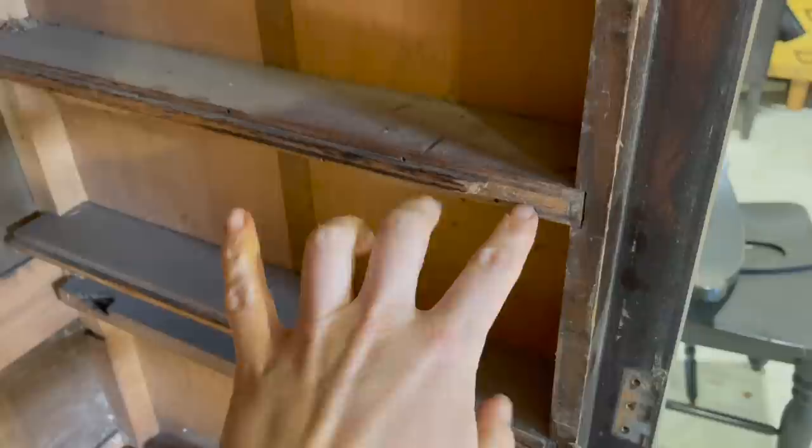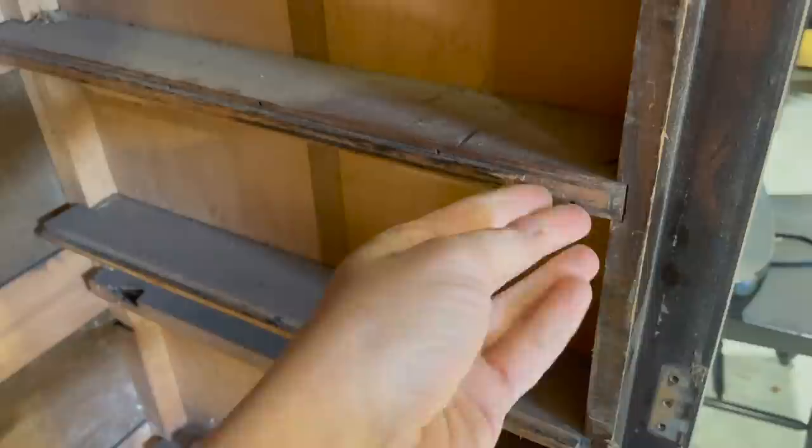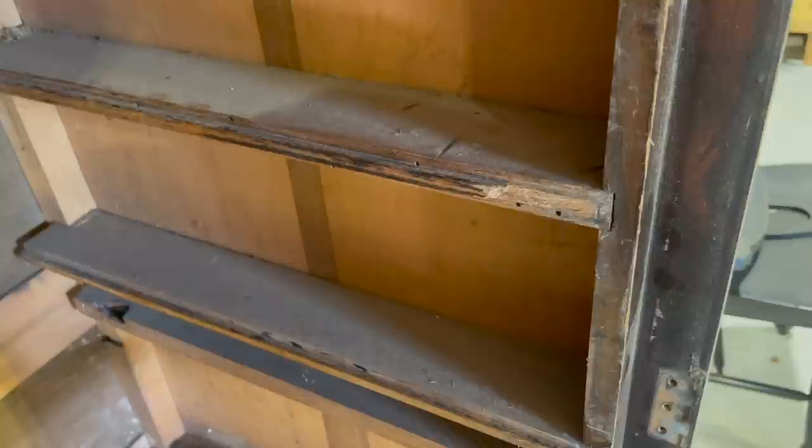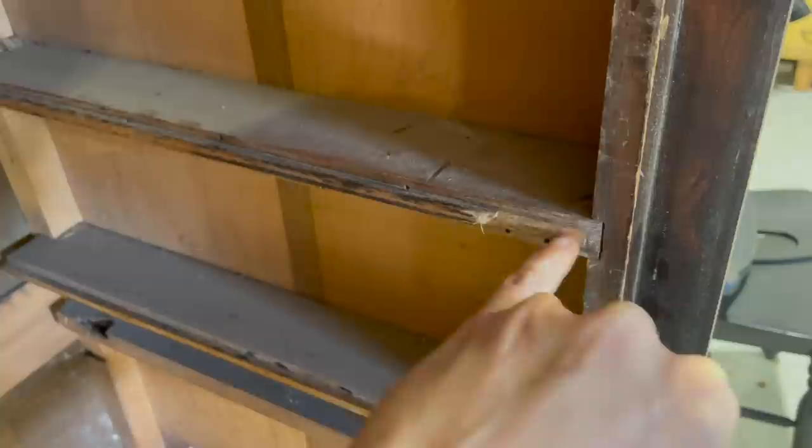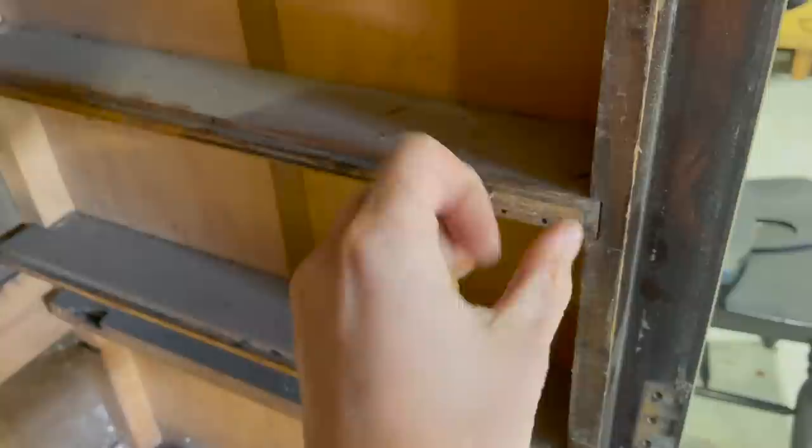And I'm thinking what I wanted to do was take them to the table saw, run them through, and put a new spline into these pieces, but I can't get them out. So I'm thinking of maybe just getting a chisel and working a groove in here, doing a couple of drill points, chiseling out a section, and then just adding in a tenon into the pieces that are missing. That'll work great for these little ones, but when I have almost the entire piece missing on this one here, as well as the top one on this side being pretty worn and missing as well, I don't want to really do that to the whole thing. That's going to take quite a long time and not a great method.